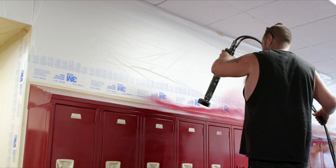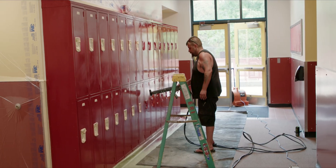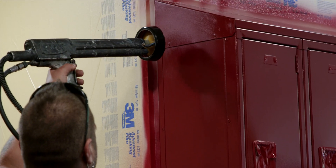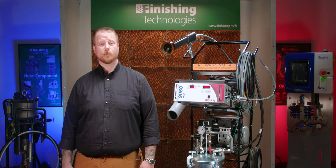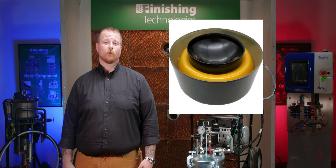This enables most jobs like this to be completed much faster and often requiring only one painter to do the work. Expect the standard 4-inch bell, which comes with the system, to coat at a rate between 10 and 15 square feet per minute. Smaller parts can also be coated using the 2-3/4-inch bell at around 5 to 8 square feet per minute. You can also choose the optional 6-inch bell which does 15 to 20 square feet per minute.